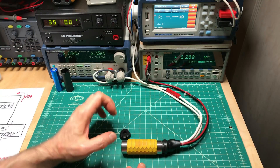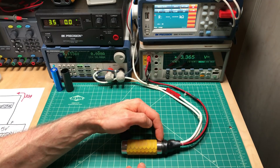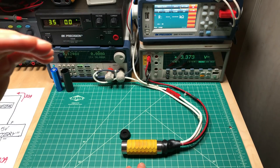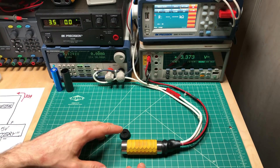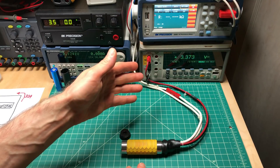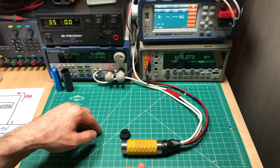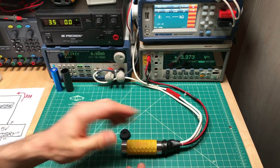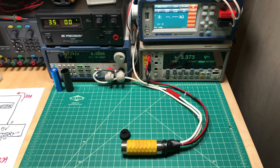Having that range — the high and the low — for each mod. I'm hoping that some other mods with a shorter button throw, different contact areas, or less susceptibility to heat expansion will show a smaller range of numbers or be more consistent. We're literally going from a 0.30-volt drop all the way up to a 0.68-volt drop — that's a doubling of the resistance. That's it for this time. The next one will be the actual testing results. Thank you for watching.